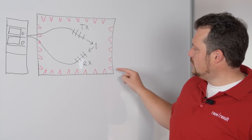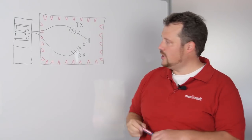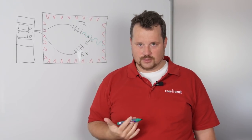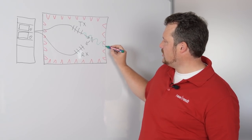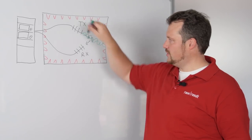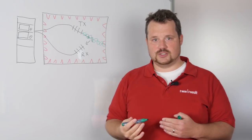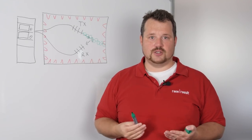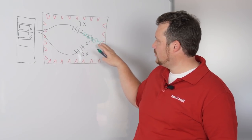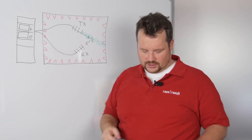The second reason concerns the absorbers. At radio frequencies, a generated wave is a sine wave coming out of the transmitting antenna, and this wave reflects off anything metal. If there is something metal nearby, the reflected sine wave adds up with the original wave and they may cancel each other out, creating standing waves that affect the whole measurement. You can never be sure if you are measuring what the transponder is doing or some kind of reflection effect.